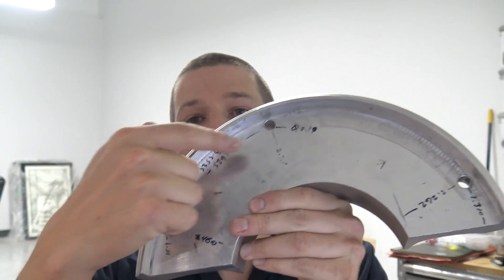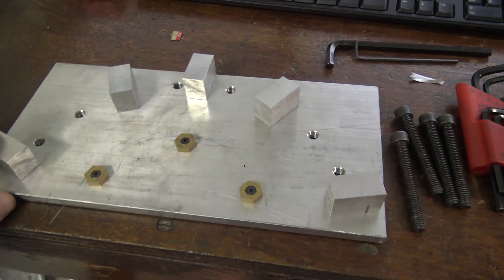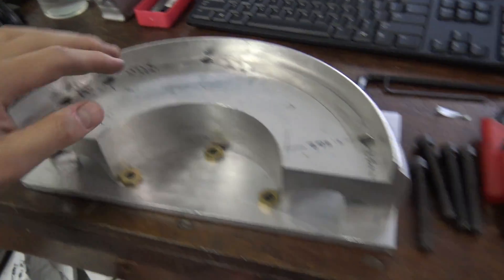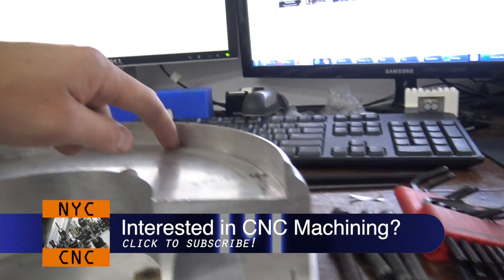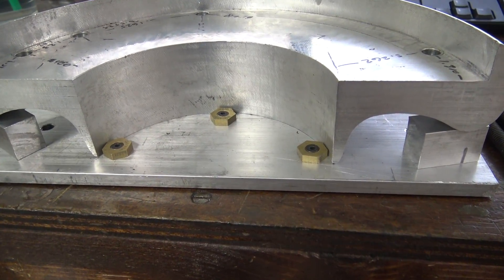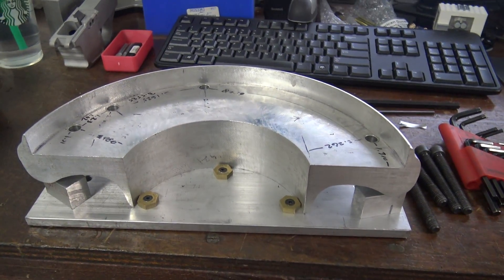You've got right now one, two, three, four holes. You've got to use those holes. You've also got a perimeter edge right down here. Here's what I've come up with: we use the Iron Worker, shear off a six-inch piece of aluminum. We machined six little spacer blocks that are about 930 thou tall — that's the distance between the proud edge here and the bottom edge there. This will set in on those blocks so we can clamp down, creating a really good connection around this band. My concern was resonance or harmonics or loose fixturing, so we added three Mighty Bites. All I want them to do is provide some amount of resistance. Let's put this thing together — I think you're going to see it's pretty solid.